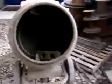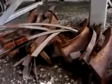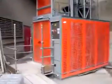It's a team of 4 of us on average working on this job. Here we have sharp sand for the slurry mix, which we pour down in between the blocks to reinforce the blocks, and that is just regular sand for the cement mix to lay the blocks. And here are the blocks all lying about. Bit of horizontal rebar there, ready to go up on the next lift to be welded in place. And the tape band that came off the previous 15 foot of brickwork that we took down before we started to rebuild. That was the steel tape that held it all together, bracing it together.